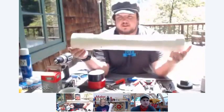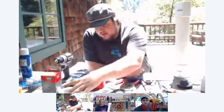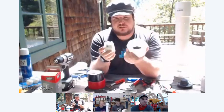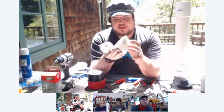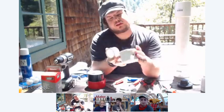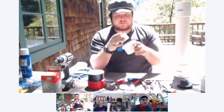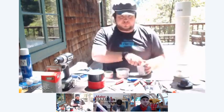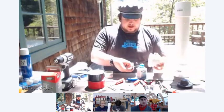These guys. All right, now that we have this, we can do our adapter. And so these are reduction bushings, all right? If you're lucky, you can find just one bushing that is the right size. But at our store, we weren't able to find the right one, so I have to use a combination of two. I have a 3-2-inch reduction bushing, and then I have a 2-1.5-inch reduction bushing. We'll have to put one inside the other, and then the other one will go inside the end of our cannon. That's just because our hardware store didn't have the right PVC parts, so we get creative.